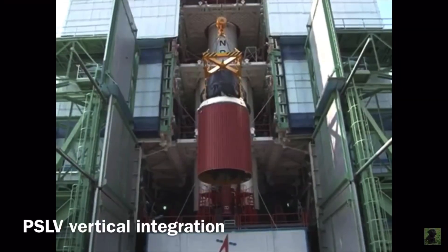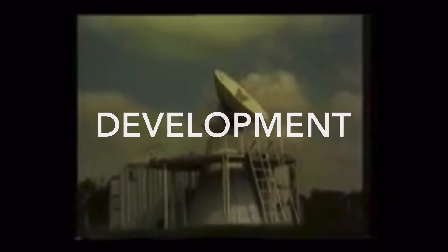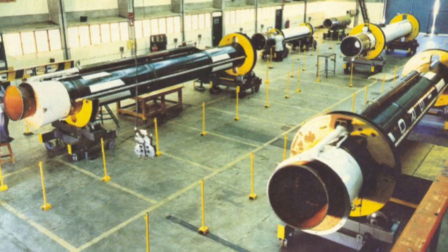This was a huge game changer and ISRO still uses vertical integration in the PSLV and the GSLV. ISRO also had to develop a brand new case manufacturing method for the upgraded ASLV fourth and fifth stages, which were made up of Kevlar and fiberglass. They also had to do this for the canted nozzles on the side boosters of the ASLV. The canted nozzles meant that the nozzles were tilted 9 degrees away from the body of the rocket, which enabled the thrust to go directly in line with the center of mass of the entire rocket, reducing efficiency loss.